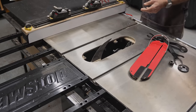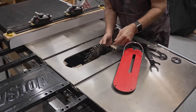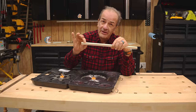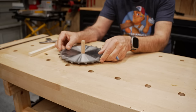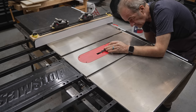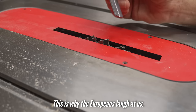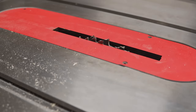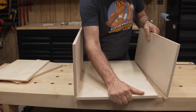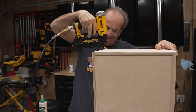You can cut rabbets and dados any number of ways — using a router table or with multiple passes on a table saw. I like to use a dado stack. A so-called half-inch sheet of plywood is always going to be a bit thinner than that, so I used an off-cut to build the stack to the exact size I needed and used the same off-cut to set the blade height. I wanted to go half the thickness of the plywood, which is actually 15/64ths of an inch — so I just set that by eye. Once I had all my parts cut to size, I did a quick dry assembly to make sure everything fit, then glued it up.